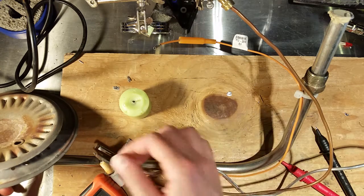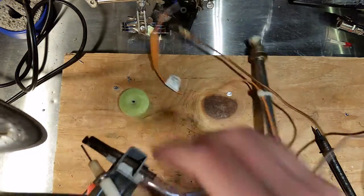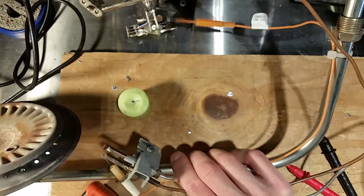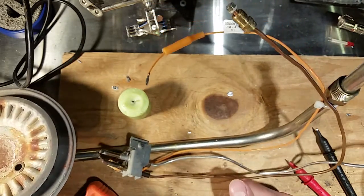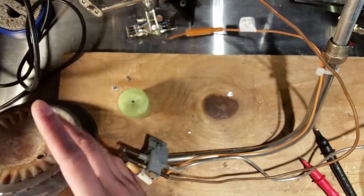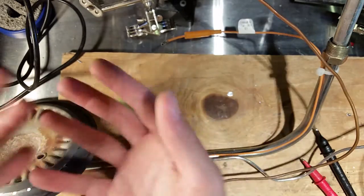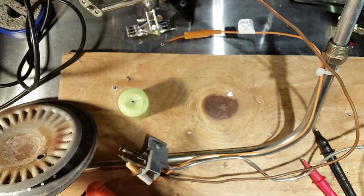So you want to take out the thermocouple or the thermopile. You can see in this case it's held on by a little ferrule, and that's what keeps it in with tension. It could also be that this thing is just all cruddy and corroded and needs a good scraping with a wire brush. These things do corrode because it's a heater element that's usually in the basement, and all that fire and heat needs combustion air, so it's pulling in all that surrounding air with all that moisture, and that's what causes this stuff to rust out and fail.